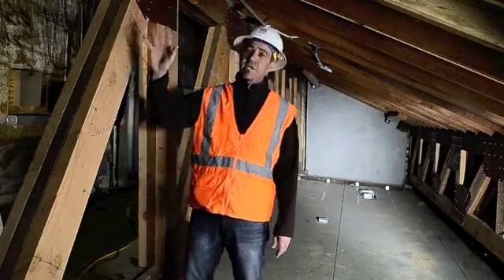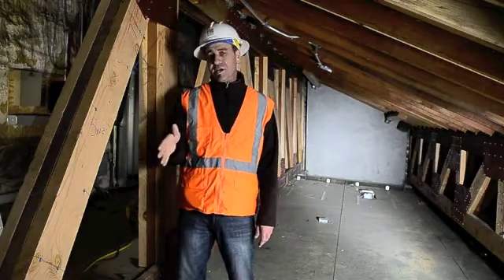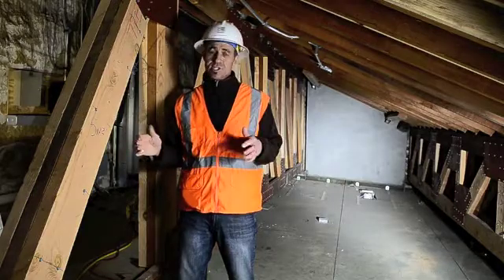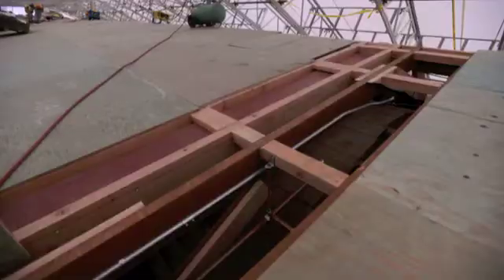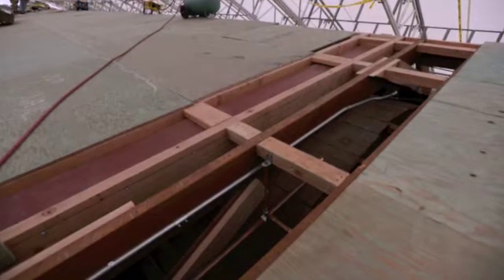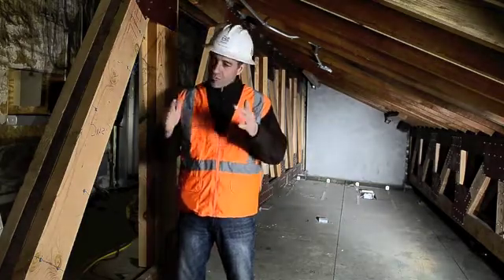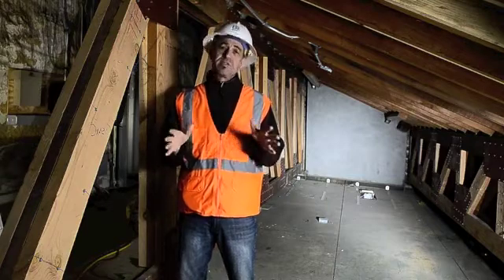We don't have one of the wide flange collectors in here yet, but as Mike said, being able to detail that stuff ahead of time before the roof was opened up was critical. If we hadn't done that from the scan data, they would have had to wait until the roof was taken off and opened up to even get any detailing done to get the lengths. In addition to that, we were able to find situations where we had dips or crowns in the roof — some as bad as collectors sticking out of the roof by three inches. That obviously wouldn't have worked when they set those in, and would have brought things to a halt requiring the structural engineer. Finding that all ahead of time and having all those collectors dialed so they went in and set and fit the first time — there's just significant value in that.